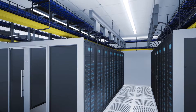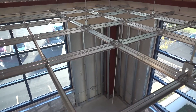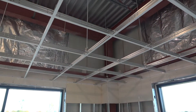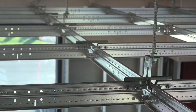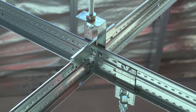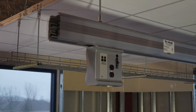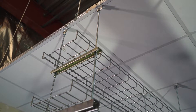The Prelude XL Max grid system eliminates air leakage, supports single point loads up to 300 pounds, and is easy to reconfigure as your future system needs change. Seismically engineered system components efficiently suspend Prelude Max from the structure as well as data hall mechanicals below the grid. Everything has been designed to minimize material cost and labor while maximizing data hall point loads and future reconfiguration possibilities.